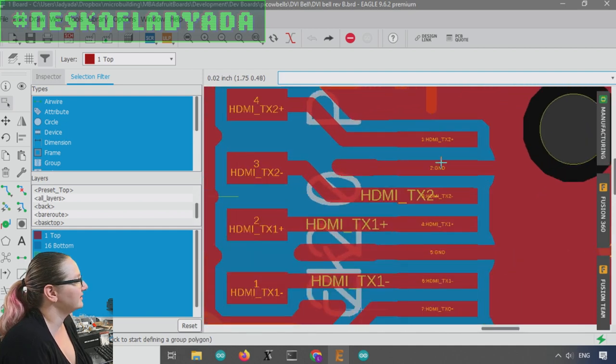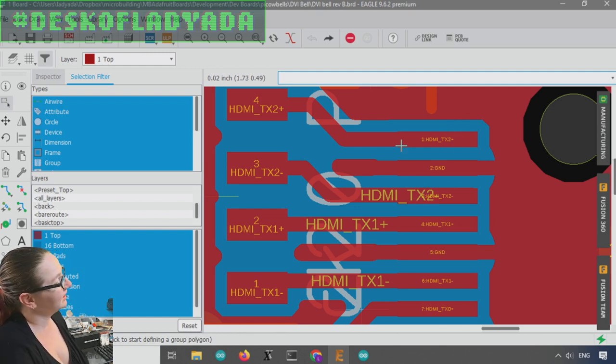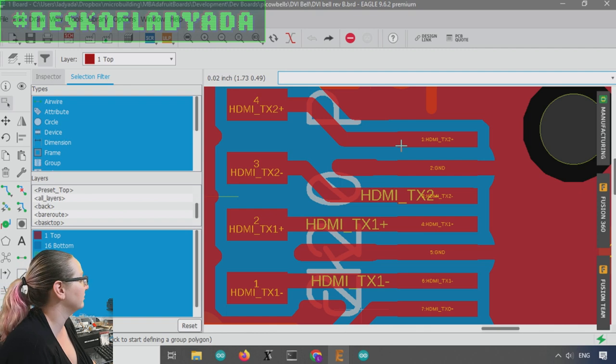So what happened is that the positive and ground were swapped, the negative worked, and so it's differential. The video capture card that Phil has is really good quality, and it's meant to deal with really terrible signal generators. So it was like, well, you're missing your positive differential, but the negative is there, and compared to ground the signal's okay, so it was able to extract the HDMI signal from it. But yeah, that's definitely going to cause problems.